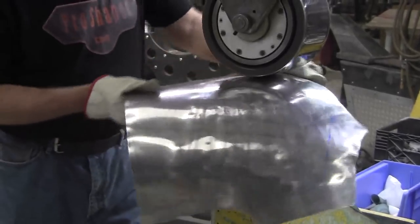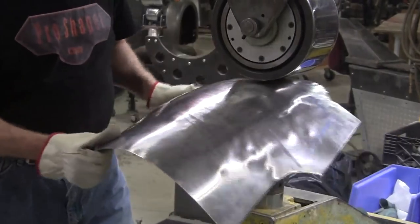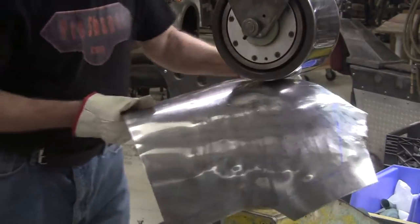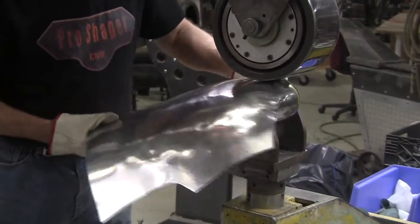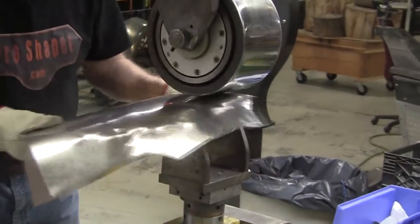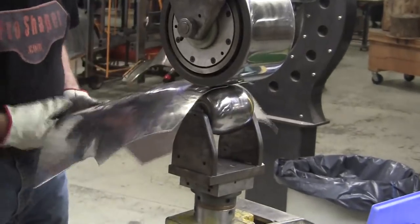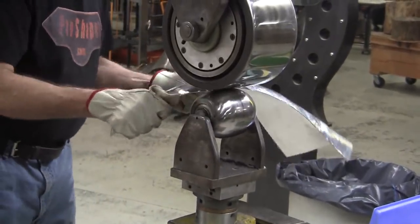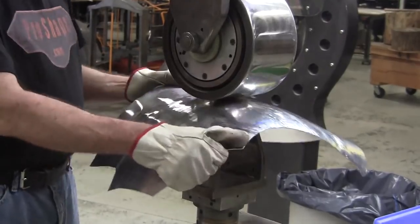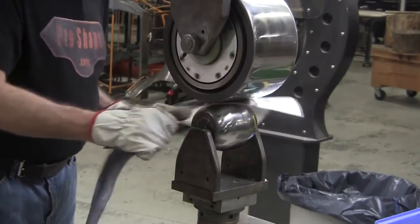On the shrink residue areas, if you go straight it's like going over a bunch of railroad tracks — bump bump bump bump. It's better to go at a little bit of an angle when you negotiate through here; it'll settle them down a lot better. Now I'm losing some of my shrink as I settle these down, so I will get more gap in my panel, but we're going to raise it up a lot on the wheel too.